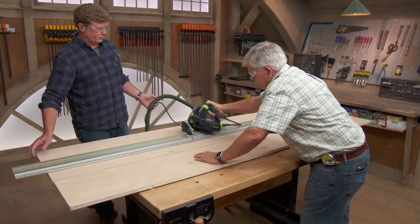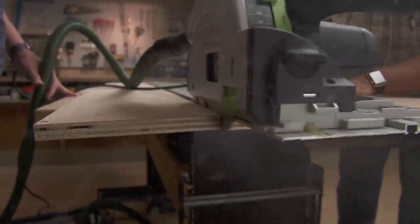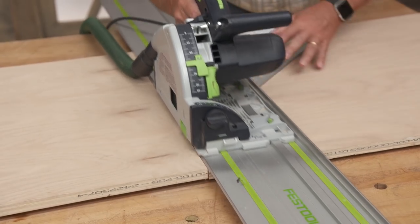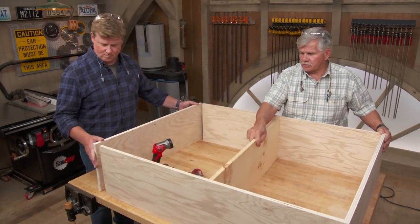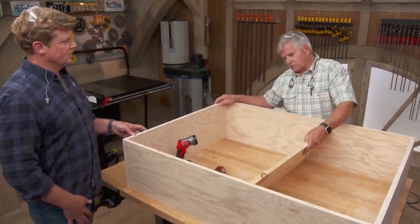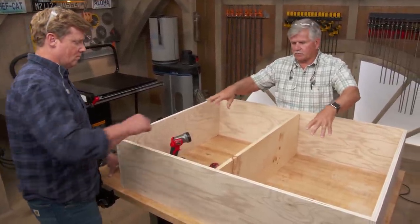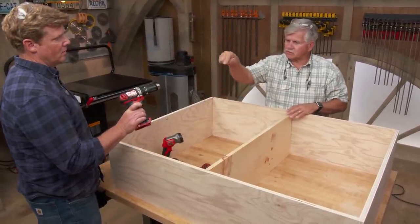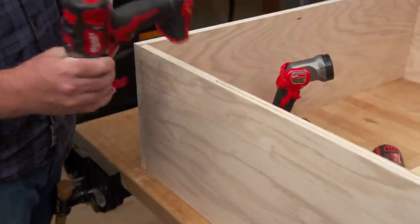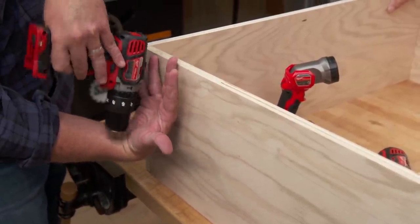Let's get started by making a couple of strips out of this sheet. The cabinet is going to be four feet wide, three feet tall, and one foot deep — so that's what I'll cut the plywood down to. I'm going to roughly hold these pieces together. We have our two sides and a piece of scrap pine that will be one of the dividers. Now I want to be able to make some shelves in here and configure them a little differently. I also want to be able to hang the power tools down at the bottom on some fingers. They'll slide right down in there — they can go this way, they can go upside down, doesn't matter. By fingers you mean you're going to cut some of this out? Yep. We'll cut it out and you slide the tool down in between the fingers. Let's get that laid out so we can cut them.